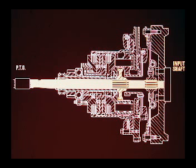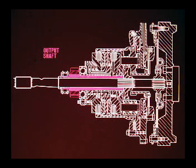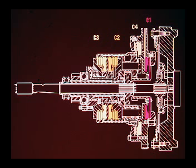The power shift transmission assembly consists of an input shaft, which also drives the PTO at engine speed, a compound planetary which accepts the input rotation and causes a reduction in output speed for a torque increase in the low and intermediate speed selections. Also, an output shaft that transmits power from either the compound planetary or directly from the engine, depending on speed selections made. And 4 hydraulically engaged, spring-released clutches.